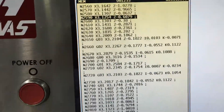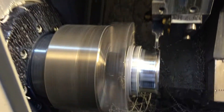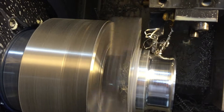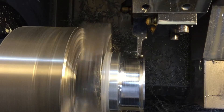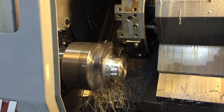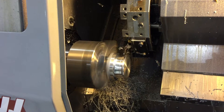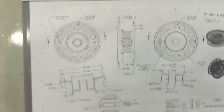How about you turn that coolant off. Let's open the door and have another look. That chip is breaking nice for aluminum. Do you know how much depth of cut roughly that is? I believe about 20, 30, 40 thousandths. We probably could have gone more than that, but it's good to be conservative anyway. So it's shaping up nicely here. I'll shut the door and let it run coolant again, and we'll look more at this part.